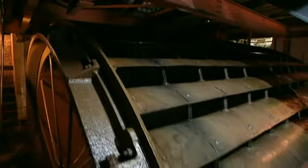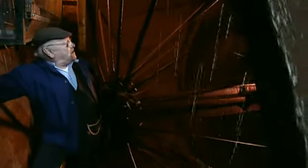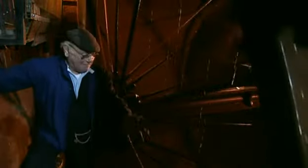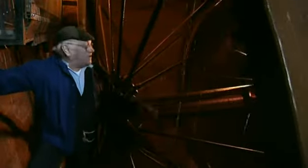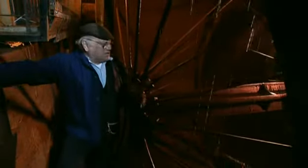The original water wheel was designed and built by Sir William Fairbairn of Manchester, who was very famous for what they call suspension water wheels. The first segment was put in the bottom of the water wheel pit and anchored to the spokes — it would be suspended. Move it round one and put another in, and eventually it would end up round. When this water wheel was first installed, steam engines were quite well developed but they were a bit unreliable. And of course this thing runs for nothing.